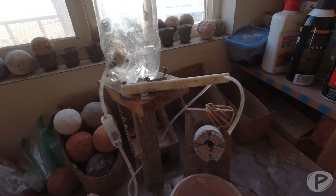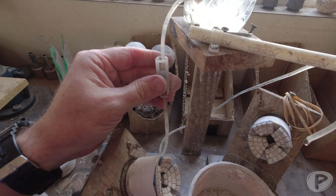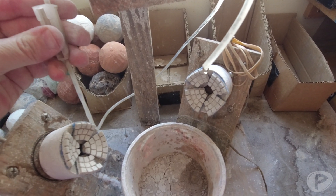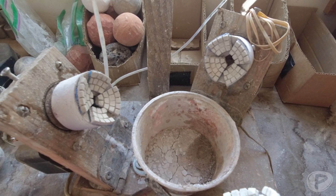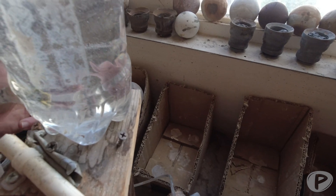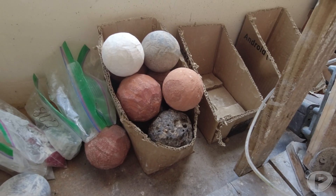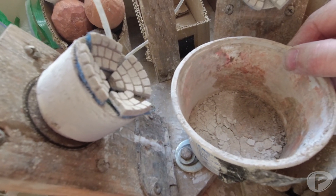On the top here, as you've seen in my videos, this is very garage-engineered — it just has a little IV slider for controlling how much water comes out, from a lot to a little or none at all. You have to have the water — it creates a slurry as the stones are turning, and as you're polishing it cleans away the fine debris so it polishes properly. I have boxes here where stones progress through different stages until they're finished.